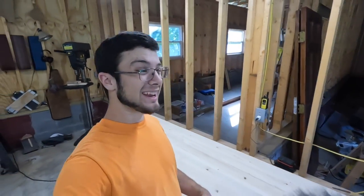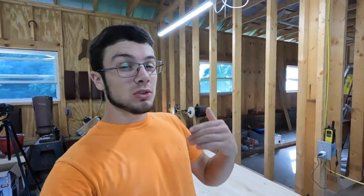I wish you could feel this right now because it feels really good. It's only at 320 right now. I think I'm gonna leave it at 320 because it's spruce, it's 2x4s, and it's not that hard. So even if it went up to 2,000-3,000 grit, it wouldn't really matter because as soon as you touch it with anything, it's not gonna be that anymore.